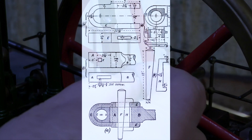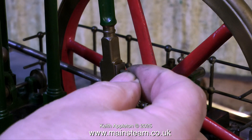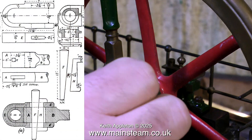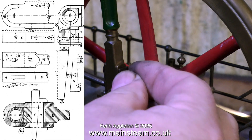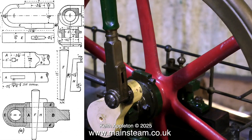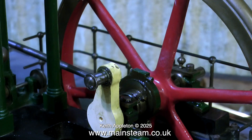Here is a diagram of how a steam engine cotter pin system works. It's a great system — very simple — and it holds the brasses in place, but unfortunately on model sizes the cotter pins generally fall out. On the diagram you will see a set screw which holds the larger of the two cotters in place. That's fine on the full size but not on a very tiny steam engine, where the bolt would either have to be unfeasibly small or very large and over scale.